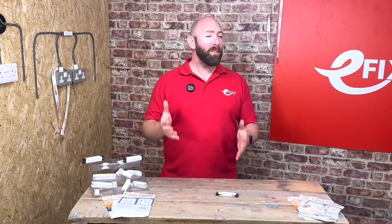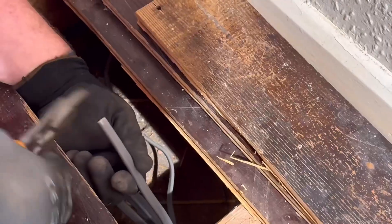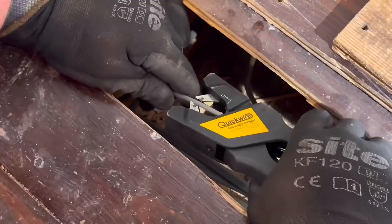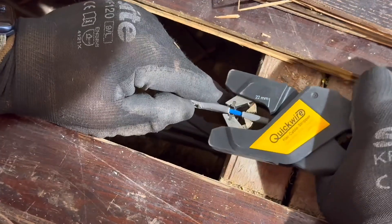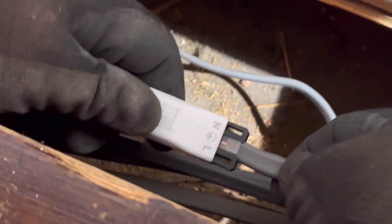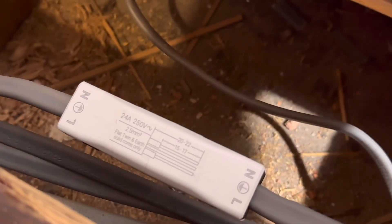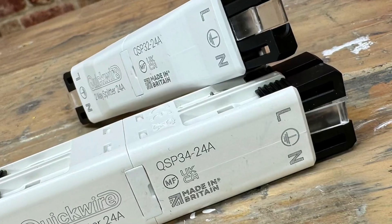Can I use the two-way splitter to repair the cable? Well I've got no slack but it's worth a go. So a quick cut and square off the ends - and I've made it even shorter so I do hope this works. I strip it back on both ends, connect one in and then make off the other, and look at that - I've actually gained a little length. Well that's it, job done and it could not have gone better. Nice chases, lovely customer who makes tea faster than I can drink it, and this awesome product - the Quickwire 24 amp junction box.